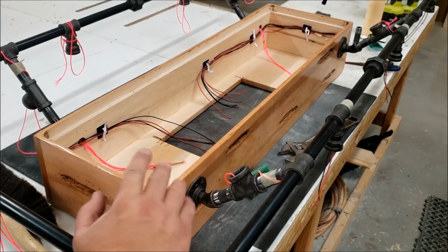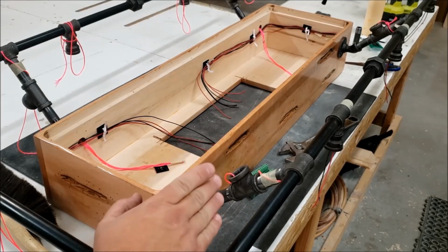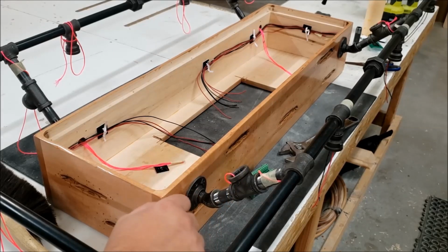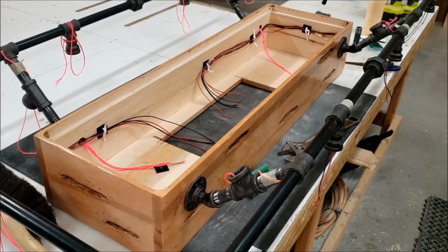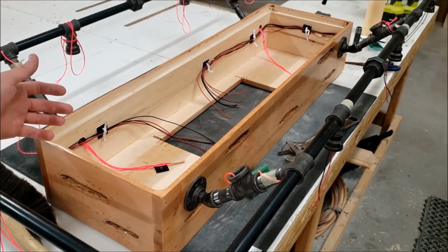Now the wire I have, it'll handle the wattage and the power without issue, no problems. But should this thing burst into flames, catch fire, and the insurance sees, oh, you didn't use the right kind of wire, because the wire I use will probably survive in a fire, I don't want any problems. So I'm using actual fixture rated wire, which is crappier than the wire I'd usually use, but it's to code.